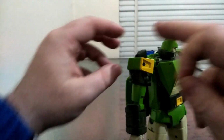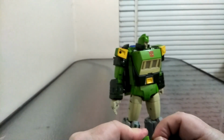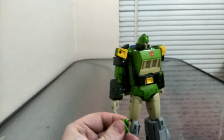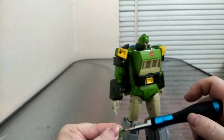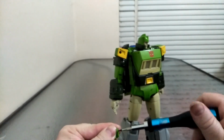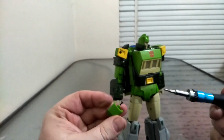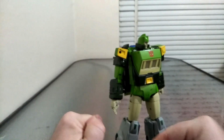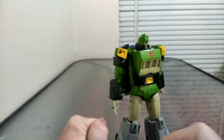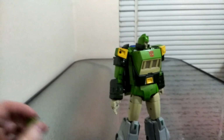And I'll show you what I tried doing. I might do it just in case it does on this too. So I basically made sure that the screw can screw through the plastic, making sure there's no excess plastic there. Even though it's got to grip it, make sure it's going to actually go most of the way in. So just sort of pre-screwing the hole first.